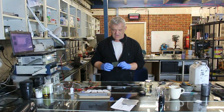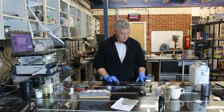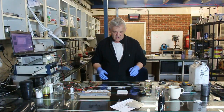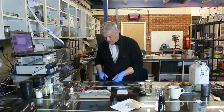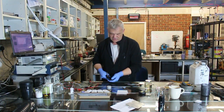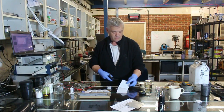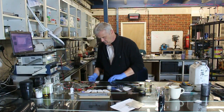I've made some previous sheets because it helps me with this demonstration. That's a vanadium pentoxide sheet, this one's a manganese dioxide, this one's a carbon. We've got some pre-cut zinc, some pre-cut graphite foil. Now when we make these things into supercapacitors, you can see how to do that if you look at the supercapacitors 101 video. I'm going to make a quick and simple dual-carbon supercapacitor here - so the same carbon on both sides. I cut myself a little bit of Celgard as my separator, pop that on, and that's my supercapacitor. It's a symmetric supercapacitor because it's two identical carbons on both sides. I can make asymmetric supercapacitors by changing the carbon.